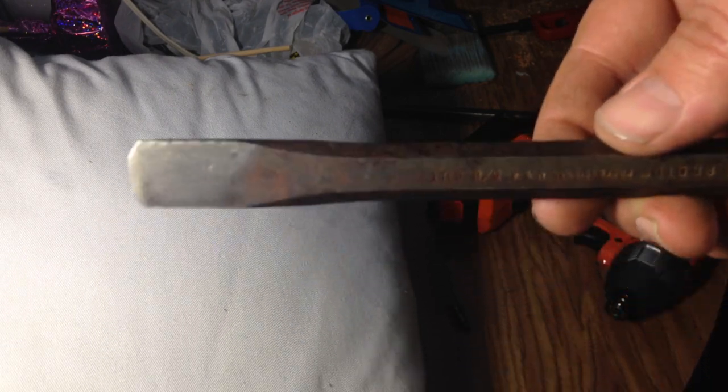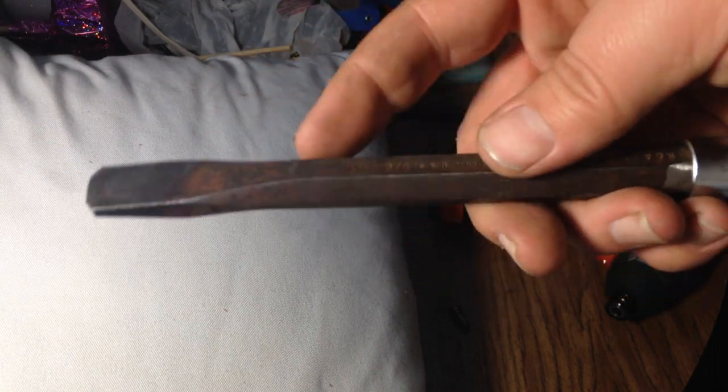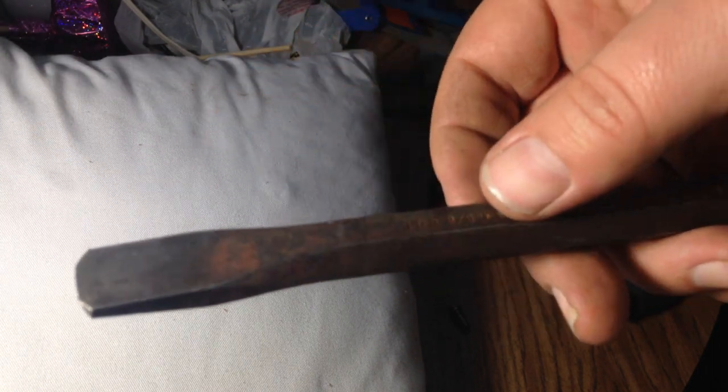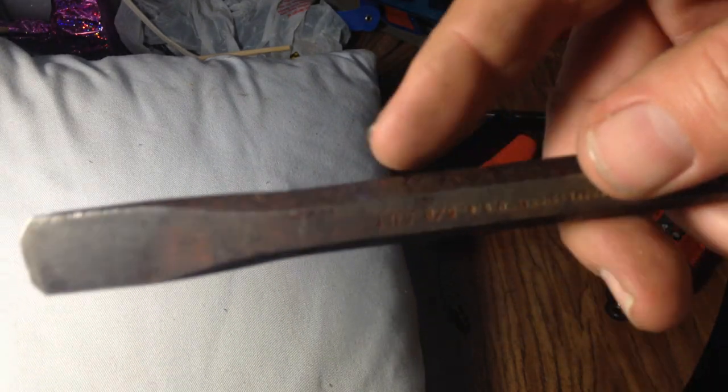I know people sell these tools for around thirty dollars online, but if you go down to Home Depot, buy a chisel with a hexagonal half-inch shank and have a bench grinder, just grind down the tip. I grinded it down about four or five times, test-fitted it, and if it had slop I'd grind a little bit more until there was no slop.